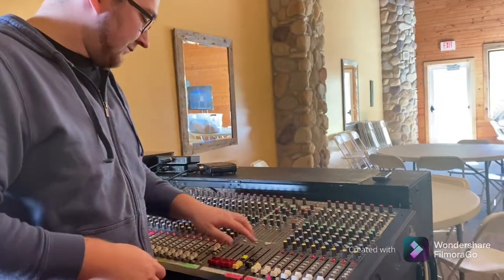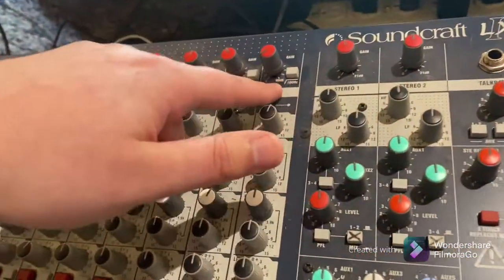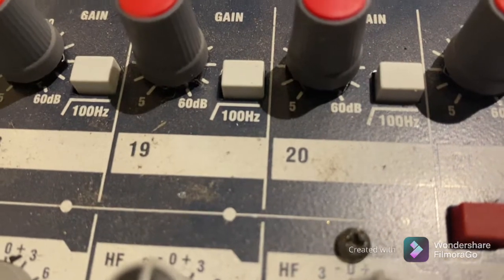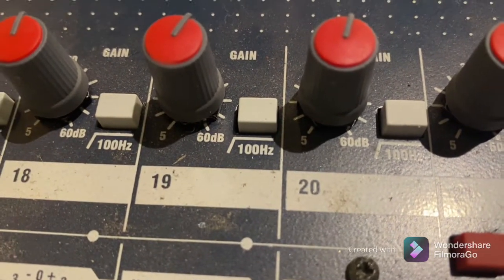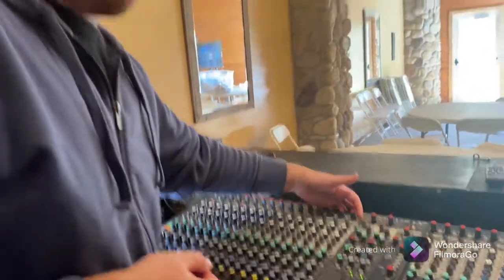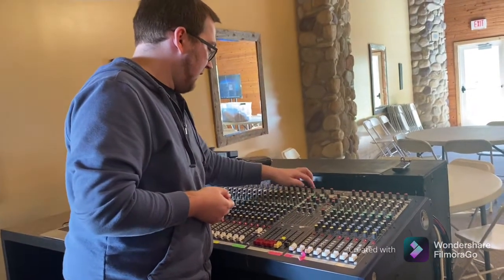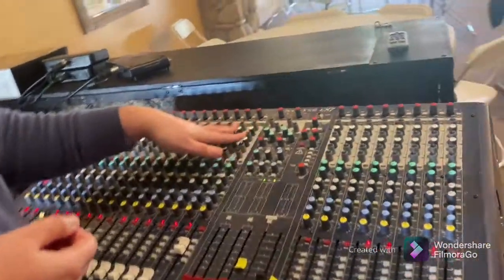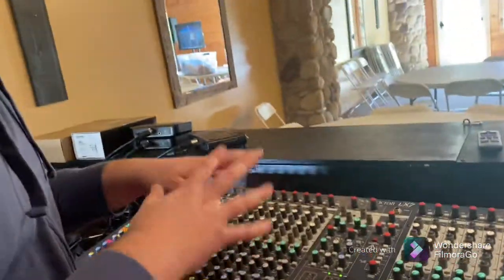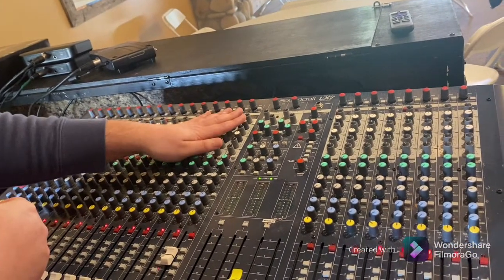After gain control we have a low-cut filter — there's a button with '100 Hz' on it. Hz stands for hertz. This is a very common feature on analog mixers. All it does is act like a bass removal switch. If something sounds muddy, this is what you'd use. These knobs together form the equalizer — an EQ takes different ranges of the audio spectrum and allows you to control different elements of a sound. We'll get to that in just a moment.